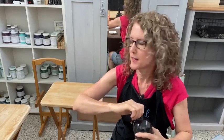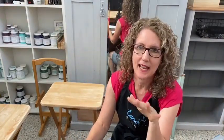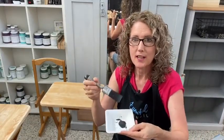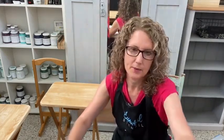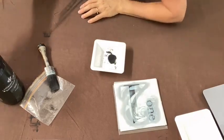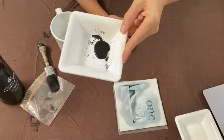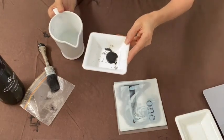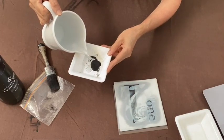All I'm going to do is take the tiniest little bit of paint. When I do a stain I simply water down the paint. Usually for a stain I might do one part water-based acrylic or chalk paint to three parts water. I'll just add a bit of water in here and mix it around with my brush. Last night when I did my first one, I painted the base with the chalk paint full strength and then dipped my brush in water to create the stain.